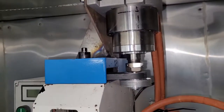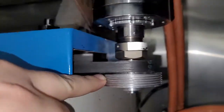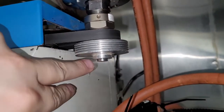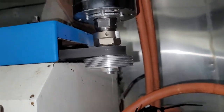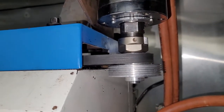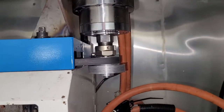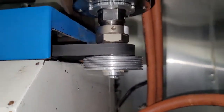This spindle so far is looking good. We redid this — we had a bolt in here. The reason we did that was proof of concept. It was easy and it would let us know if this motor was actually going to work. And it did, but this vibrated. So what we ended up doing — my boss at work kind of taught me this — I wanted to get a custom part machined. But what I thought was I could probably buy some drill rod that's actually the right size and just chuck it up and put the pulley on that. That piece of rod was like $12 or $14 — it was cheap. And so we did it, and you know what, it worked. It kind of saved me from having to design a part and getting it manufactured, plus when it's custom, you might screw something up. So this was very quick and easy and that solved that problem.